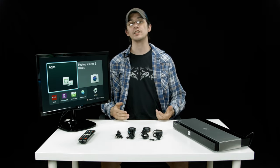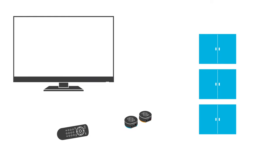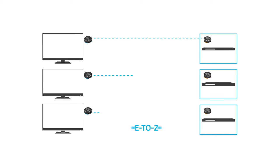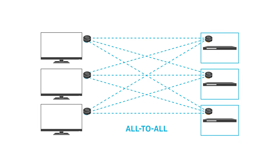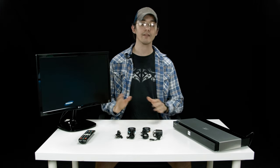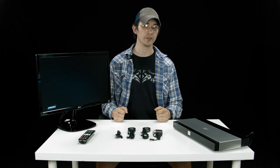The configurable channel switching lets you take the convenience even further. What if you had more than one AV closet or multiple TVs in different locations? The easy and powerful multi-zone features let you pair any combination of receivers and emitters so you can control any of your repeat locations from any of your received locations. The Blast IR Wireless Pro has 10 selectable channels, so you can have up to 10 zones, and each zone can have as many emitters or receivers as you want.